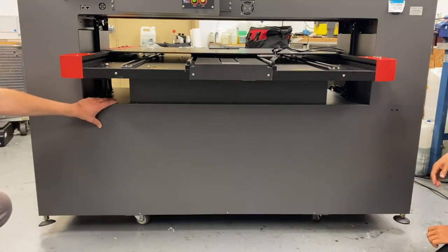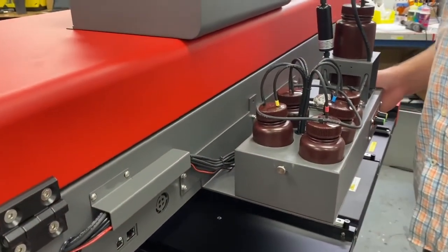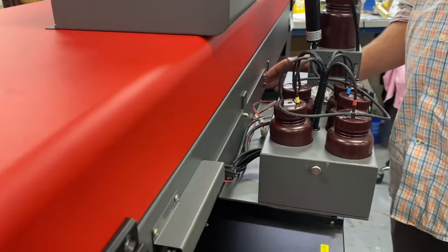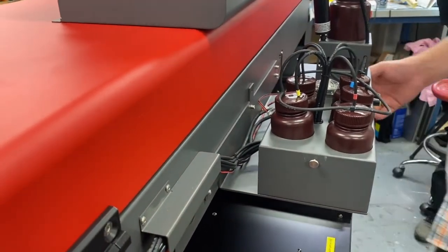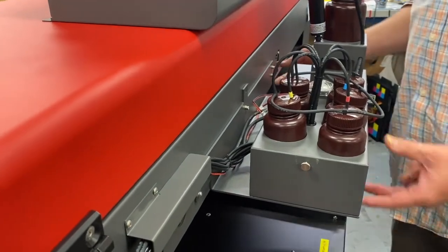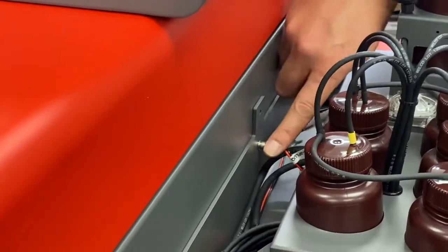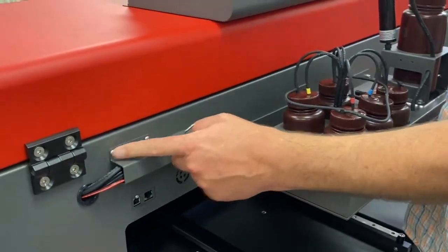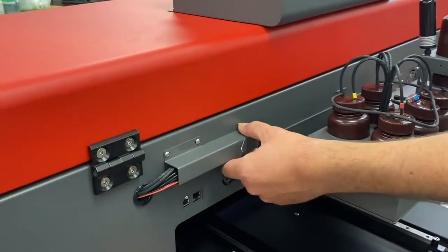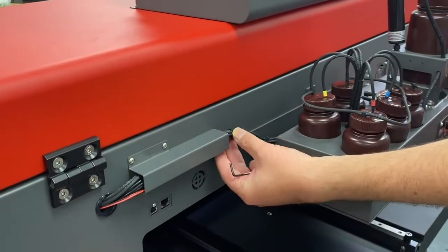And then you're done. Now, depending on how much clearance you needed, you may have had to remove this WIM system. So I'm just going to point out all the screws that mount this system. You have two here, one in the middle, and two here. Also, there's a little guard here for the tubes and wires that can come off, to give you a little more clearance. It's just two screws here. Just make sure you don't pinch anything.